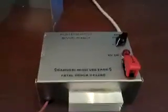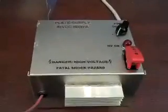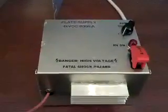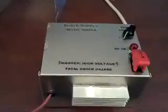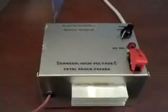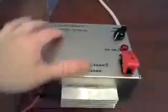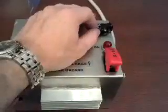It seems to perform quite well. I get about 2.2 kilovolts under load and about 4.2 kilovolts open circuit. It is a constant power controller with an upper limit on current based on the set point. I haven't figured out exactly how that algorithm works, but it doesn't really matter for most purposes. You just set the power and go with it, understanding that you're going to get open circuit voltage until your load draws enough current to match the power setting. Then the pulse width modulator will start to limit the output to keep it at that set level, so you can use the power control almost like a safety feature to protect your device from overloads on the secondary.